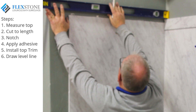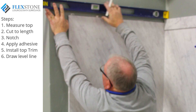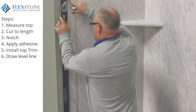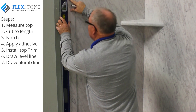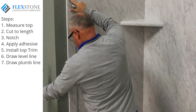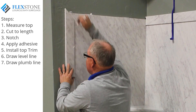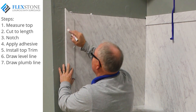You now draw a level line from the back wall trim piece — this mark will be the top side of the sidewall trim piece. You also need a plumb line marked on the outside of the vertical trim piece, or the longer trim piece. Just a small mark near the top of the trim piece will do. These marks represent measure marks for the two sidewall trim pieces.